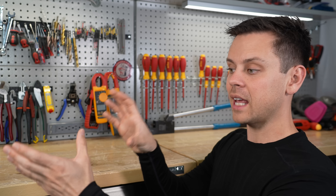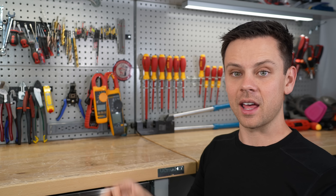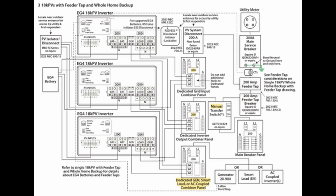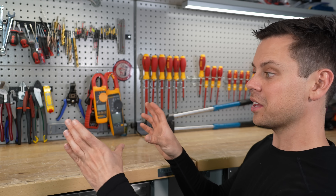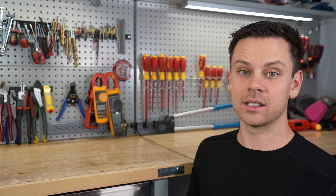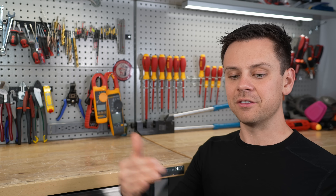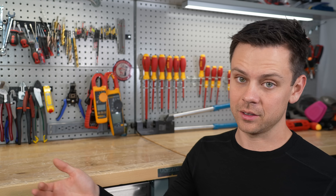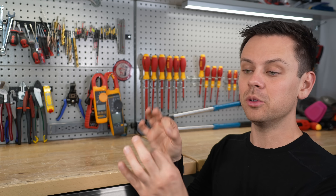It's very easy and cheap to wire up one gateway, and really cheap to add more inverters to it. It also organizes your system — if you think about the wiring schematic for multiple transfer switches, it's hard for a beginner to understand. But with gateway systems, you just put the gateway up and connect whatever you want to it. You could have just one inverter or multiple micro inverters — you essentially create your own micro grid, where your batteries, loads, and solar panels can feed in and out as needed. Instead of running massive expensive cables all over and trying to cram everything next to your meter, you can put the batteries and inverters wherever you need them.